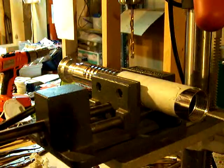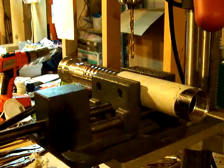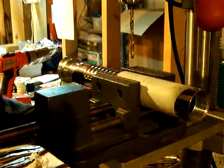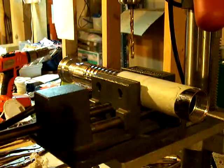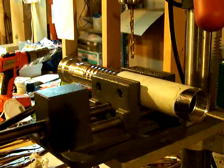What I got on there right now is a 3/16ths drill bit, and then we'll step up to probably a 7/16ths, and then finally the 5/8ths, which is pretty close to 16 millimeter. That should allow the switch to fit right in. We'll go ahead and drill the hole.